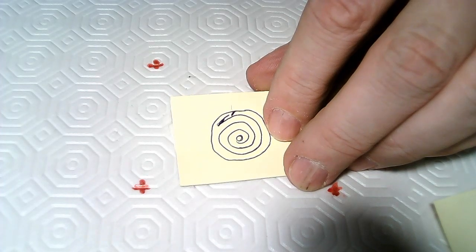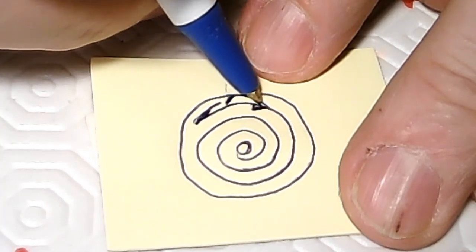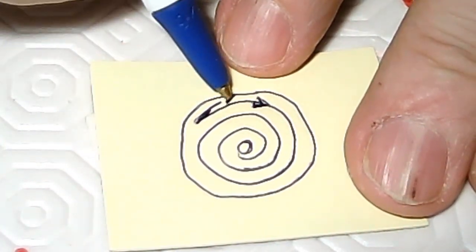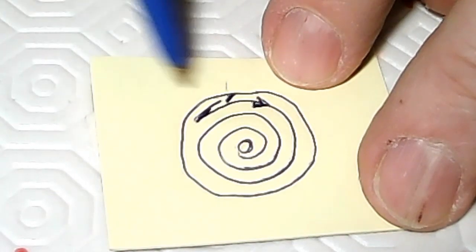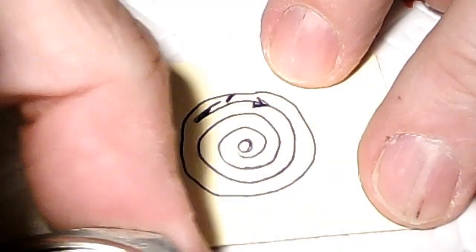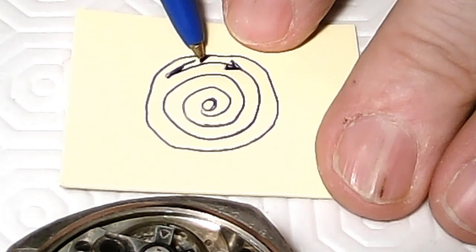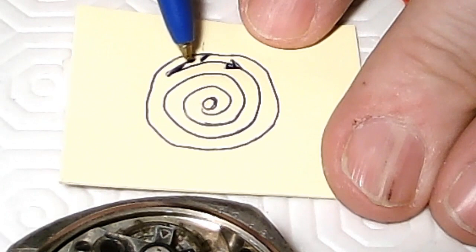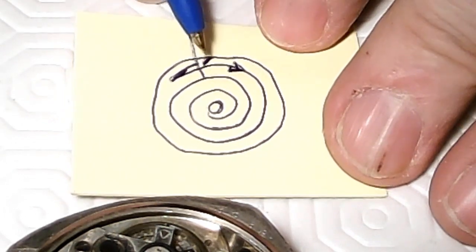So that in fact, when the spring, let me zoom in here, when the spring pulls in this direction here, it catches on this notch, and then when you wind this up, it holds it in place, so you have no issue with the notch. So as you wind the watch up, this stays where it's supposed to be, right? In the case of this movement here, what's happening is that the pressure from the wind, there's got to be either a problem with this notch going down, or this is rounded too much. The end here is rounded too much, and it's causing it to slip over the notch, and then it just goes all the way around again and stops right here. Then I'm able to wind it a few turns, and then it slips again, right? And it's not meant to slip.